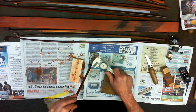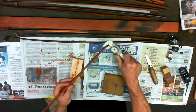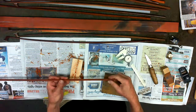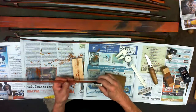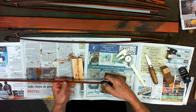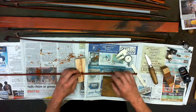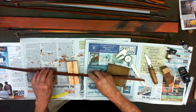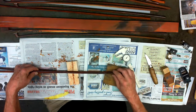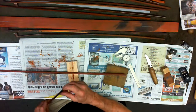Let's just check the width down here — it's about 8mm. Nope, that's 9 — that's the thickness there. We do leave that a little wider down here where the frog goes; we don't want to take any more wood away there. Once we fit the frog, we'll shave away the excess so it's nice and flat and flush. As you can see it's a little too long yet — we always like to have it too long so you can grab it and put it in a vise if you need to. We'll cut that off after we drill the mortise, make the nipple on the end, and drill a hole.